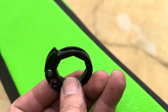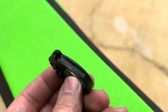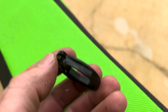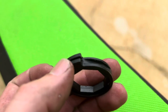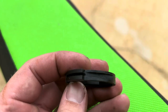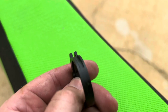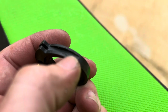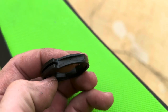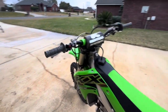The piece is all machined. You can see that second shelf — it's going to help it turn. I think I'm going to blend that area in a little bit with a ball end mill so it's not such a sharp turn right where the cable comes out at the throttle stop. I'll use some sandpaper or a ball end on the Dremel to clean that up, and clean up that little shoulder where I did the second angle bevel as well. That's pretty much what we're looking at.